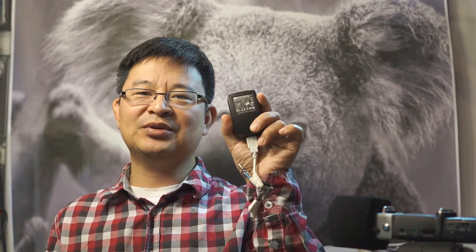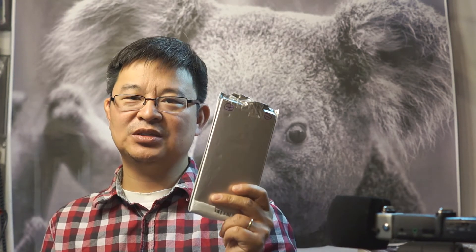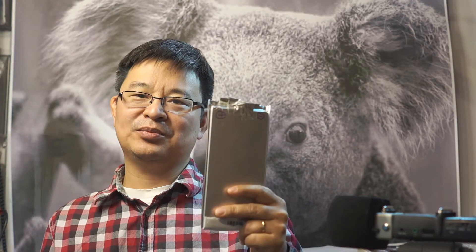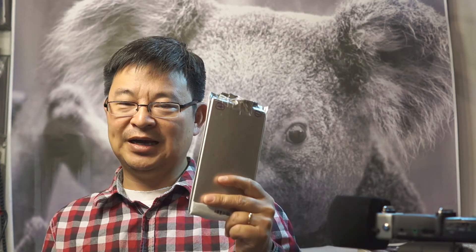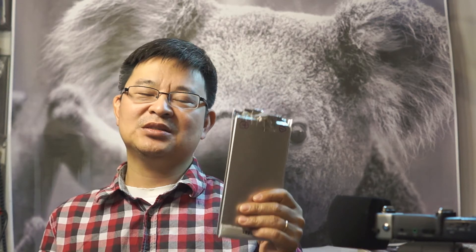First you accelerate charging with 2 amps, then switch to 1 amp. The 1-amp charger takes it from 3.8 up to 4.0 volts. You must monitor the voltage as it climbs — do not leave the lithium battery unattended. This is a DIY charging setup with no protection circuit against overcharging, so you have to be present the whole time. I use a voltage monitor to keep track.